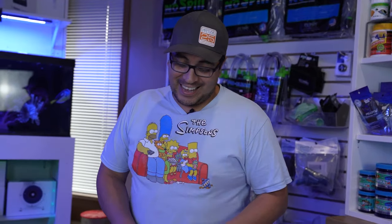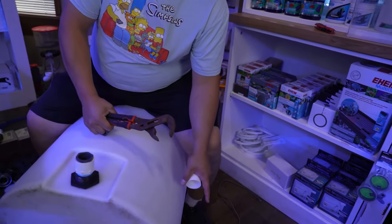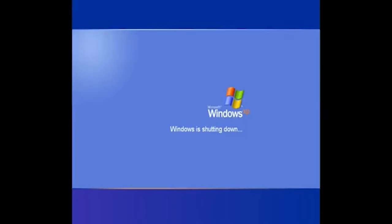Today we're gonna learn how to make a water mixing station. AKA I'm gonna show you how to do it. We're gonna be using 65 gallon vertical containers along with an oversized pump. The reason for that is because the location where the mixing station is going to go is a basement, so it needs to go up 2 stories high.